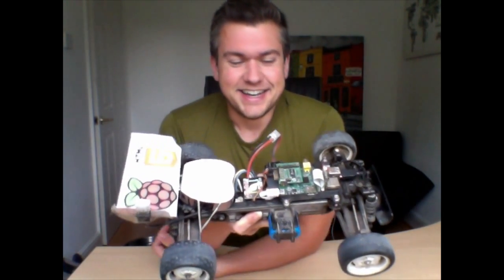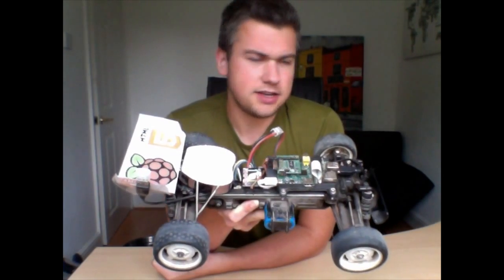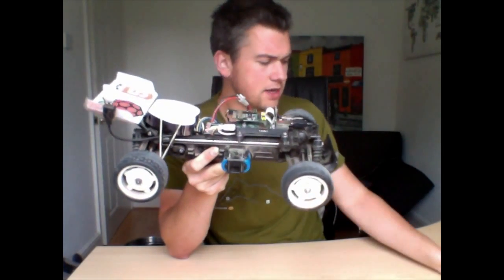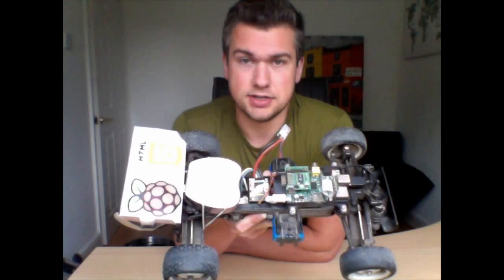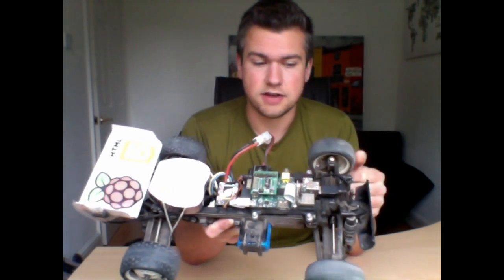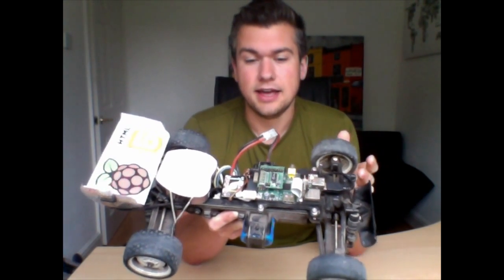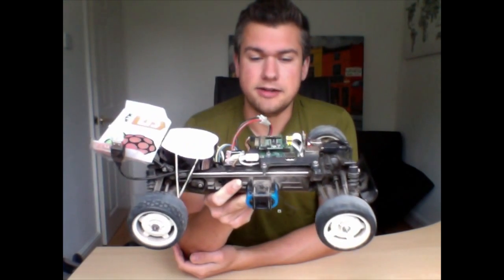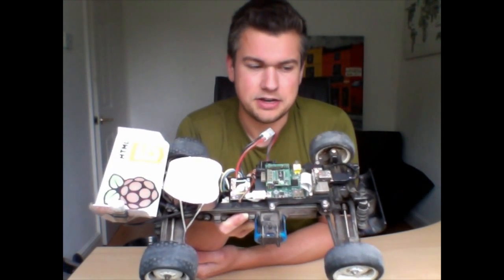You might have seen my last video — it was about two or three refreshes a second. You'd move the phone or the device, and as you rotated it the wheels would kind of stutter round. I wanted to speed that up, and I also wanted to learn about a new web server called Node.js. It's a full JavaScript web server that runs a single session, rather than starting a new thread every time a request comes in. It's based on Google's V8 JavaScript engine and basically pre-compiles your JavaScript and executes it. It didn't take very much to learn, and I got about eight, nine, maybe ten refreshes a second — which is more than enough for a car like this and makes it really smooth. About a four times increase in speed over running Apache.